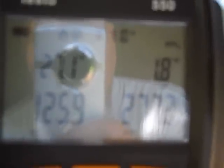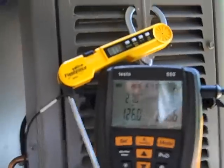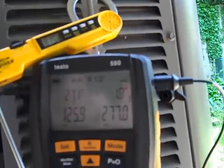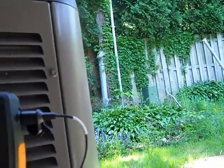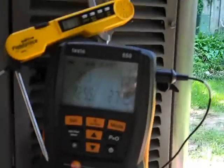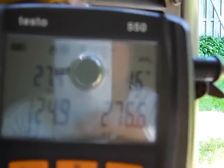Pressures by the chart — I should have a subcooling of six. We're at 1.6, so we need to add some charge, as I anticipated. The evaporator's full of vapor it seems, and so is our condenser, pretty much.